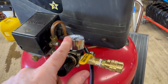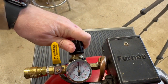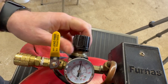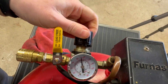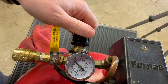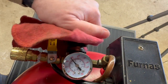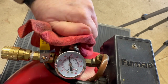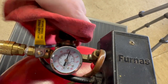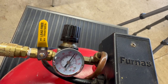I added this and replaced the air pressure gauge. For those that don't know how this works, you turn this knob. I sprayed soapy water on this. There's a locking ring there, and as you can see, as I turn it out, the pressure on this airline drops. You can have a maximum of 135 pounds per square inch. It'll raise slowly — it's over 100 pounds there. I really don't use it over 100 pounds, but you can see it's going up. The six-gallon compressor works well for most things around here.